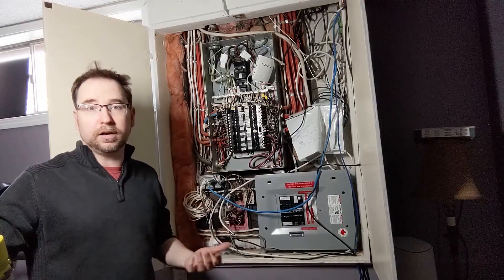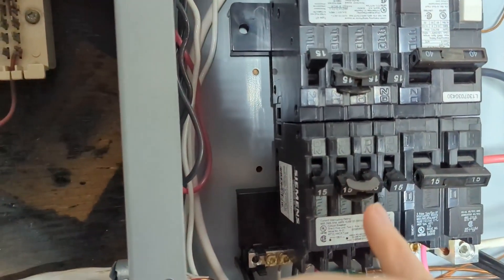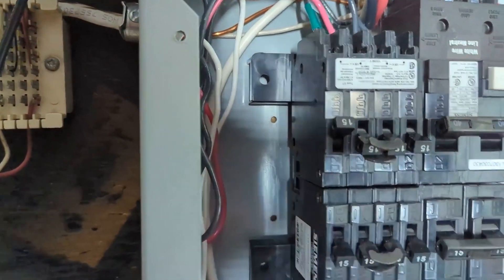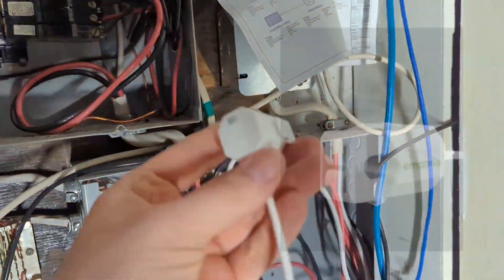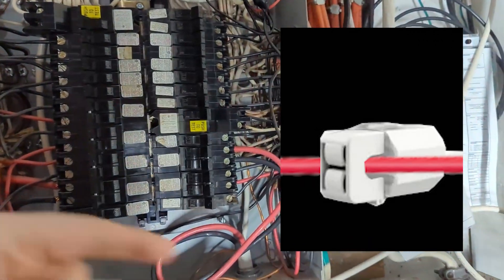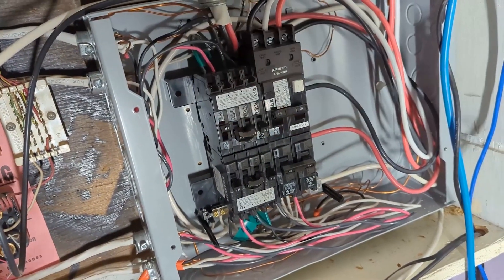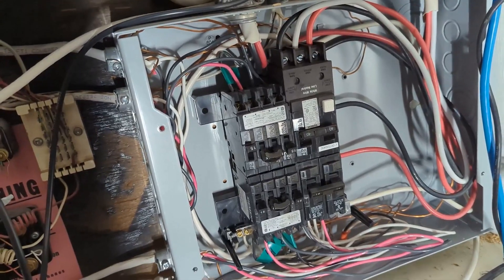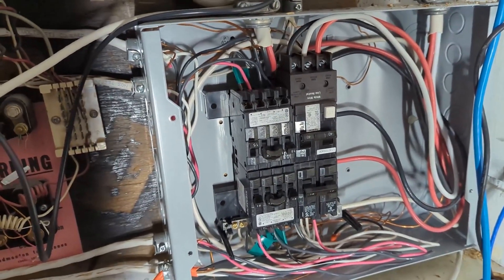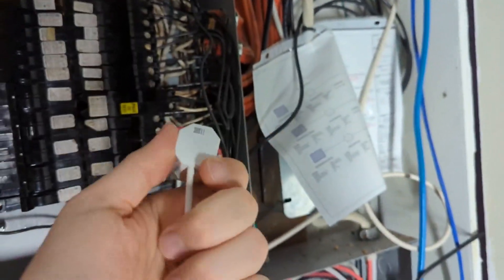I have a sub-panel with one, two, three inverters for my grid-tied solar panels. I want to monitor those three circuits using the 50-amp monitors. These are the same monitors used for individual circuit usage, except the load direction is reversed — power is coming in rather than going out. In the app you can designate these as solar generation circuits, so the system knows this is power generated by the solar system, not power being consumed.